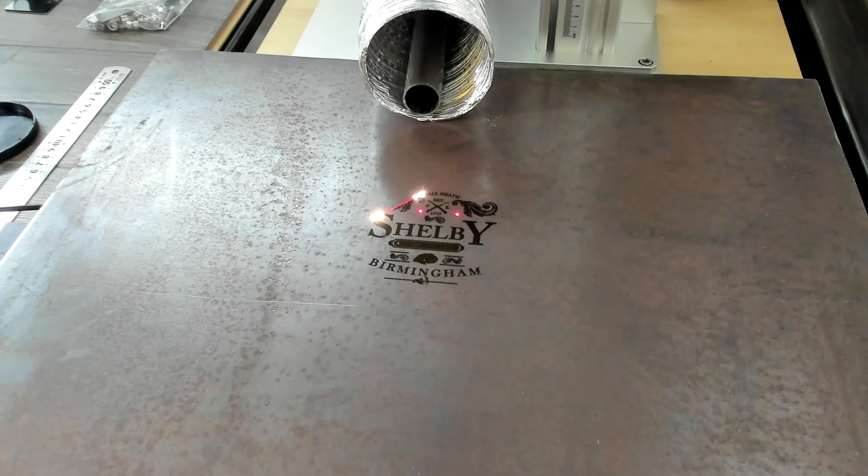I'm doing five passes here — I don't know how this is going to turn out. I've got some pre-loaded settings from Laser Everything; it seems like a pretty good starting point and I can expand on that as I practice more. This is the first thing I've ever engraved — I ran some test squares earlier. We're doing five passes at 42% power. I'll just fast forward and let you guys watch along.